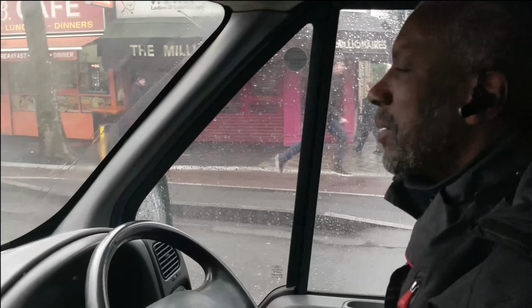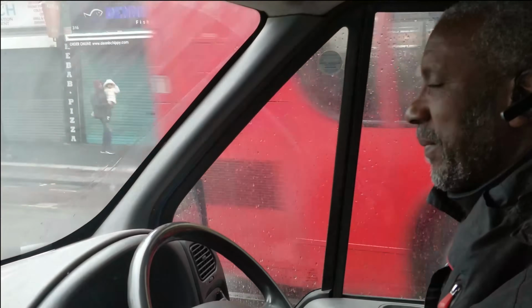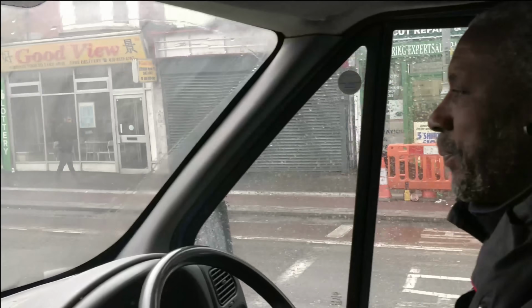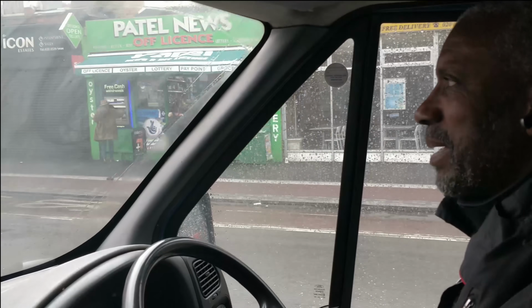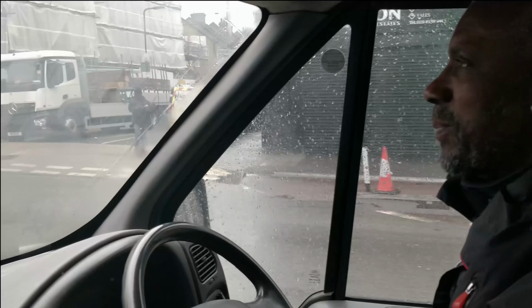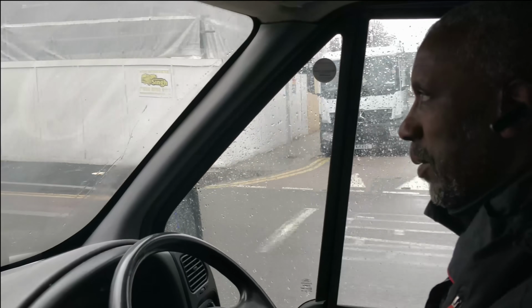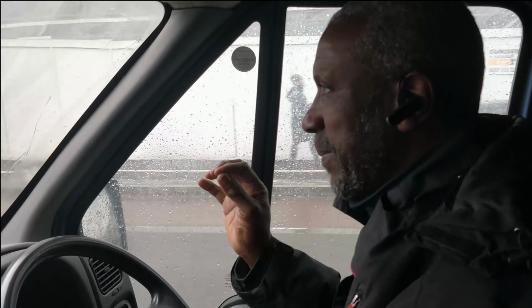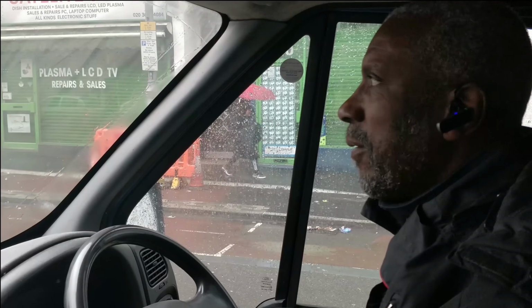The RCBOs are individually more expensive, but in the long run it does save you a bit of time and money, because you wake up in the morning and you've lost power. You go to your fuse board. If it's an RCBO, you see exactly which one's tripped, and if a good sparky did the job, you'll have labelled it. A lot of times it could be an item plugged into the circuit that's developed a fault and it's tripping. So if you've got an RCBO, one, you directly know which circuit, and the other circuits aren't affected.